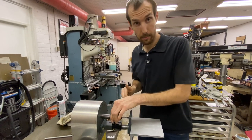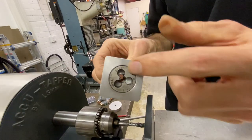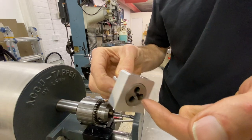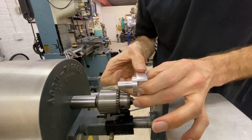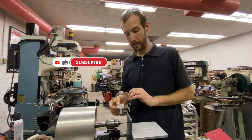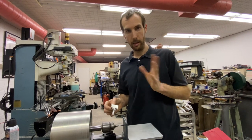This machine is mostly made for holding taps, but I'd like to make an adapter for holding dies also. This is a little die holder I made for doing die threading in a lathe — it holds the die in the front and has a round shank on the back so it can go in the tailstock, and then you can slide the tailstock and quickly thread and unthread on the part in the spindle. I'd like to be able to do that with this machine as well. We do lots of things where you have to thread the end of a long rod, or maybe a small turnbuckle with a left-hand thread on one side and right-hand on the other, and you need to make them very fast to meet a reasonable price point.